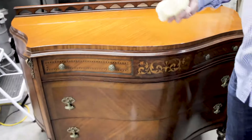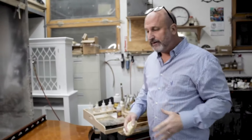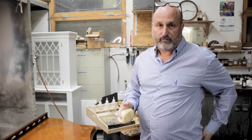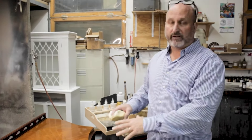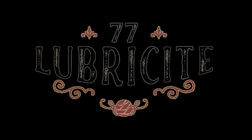That would be my finished coat. It's a little too shiny, so I'd let this dry — we tell clients to let it dry three days in the house. We'll let it dry in the shop for a few days. I'd probably give it a light steel wool, then a coat of paste wax — another product my brother custom makes — which gives it a more supple, satin semi-gloss luster rather than this high-gloss finish.